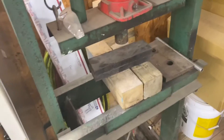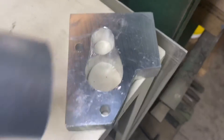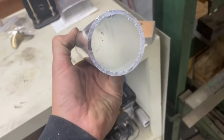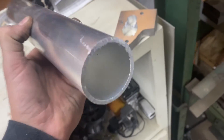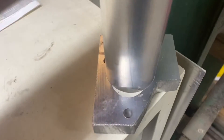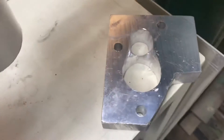All right, the next step — I'm here at our press and I've got my piece of aluminum milled out. What I've got to do is take this round piece of pipe that's the size I need to be able to attach the carburetor, and I need to make it an oval so that it will go down onto this somewhat oval shape I have here. So I'm going to squish it in the press and see what happens.